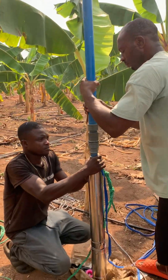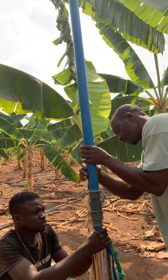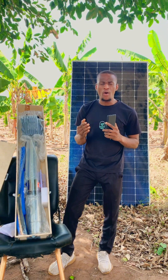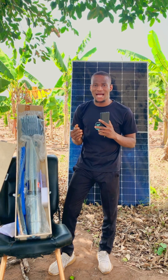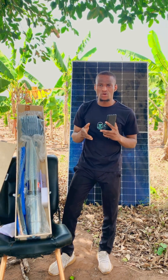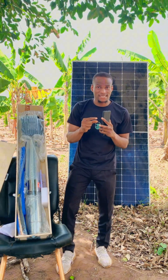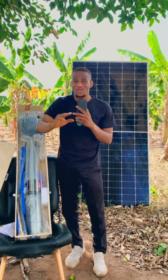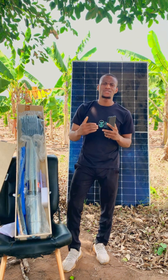The depth is very, very important — it should actually be the first thing you check before you buy any solar pump. The depth to which a pump can go should be checked first. There are some pumps with a maximum depth of 50 meters, some with 100 meters, and some that can go as deep as 200 meters. So if you buy a 50-meter pump to use in a borehole of 100 or 150 meters, it is not going to be able to pump.